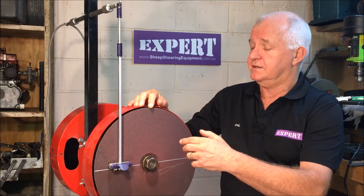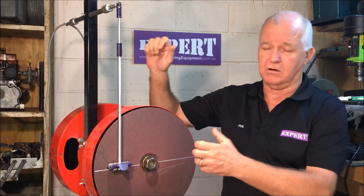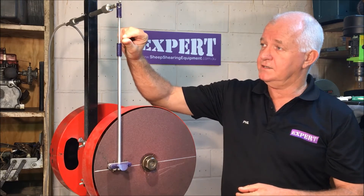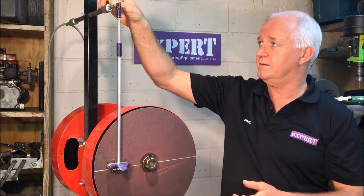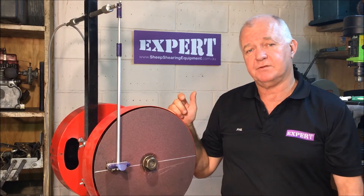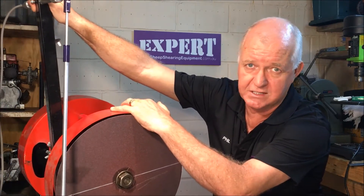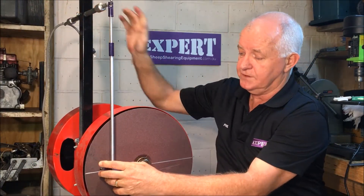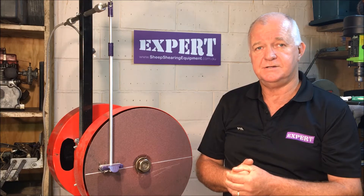It's quite simple. Once you've got the grinder adjusted you can mark it if you like. If it's your home grinder it's fine — just adjust it, lock it up, and keep doing the same thing every time. Or if you move it around, you can put a little cut in your grinder with a hacksaw blade, just mark the rod in the pendulum rod, and mark your grinder so you can put it back to exactly where it was. Some people think the pendulum not hanging right is a problem, but it doesn't really matter — the pendulum can hang out at a funny angle and still be adjusted correctly.